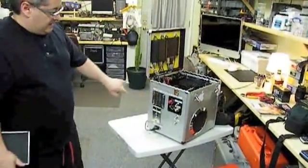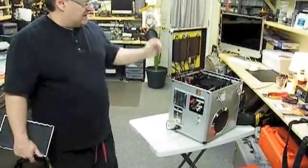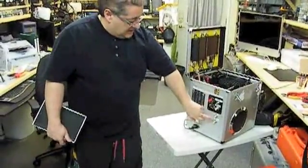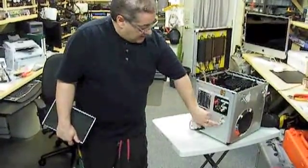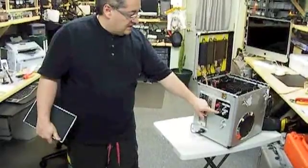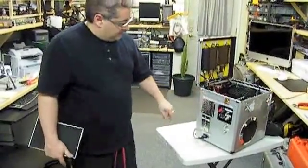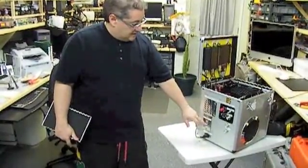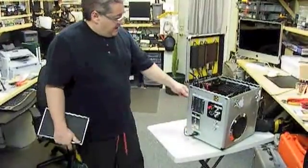This is where all the connections are made. I have a connection for an APRS antenna — I have a small Kenwood that I would put inside here to run APRS with the GPS unit mounted on top of the box. I have the main HF coax connection, a spare coax connector which is going to be hooked up to the 706 VHF port, and then the HF port. I've got external current connections for 12 volt, and also a connection for 12 volt in from a battery or a cigarette-type adapter from a truck. I have a panel here for the DB9 connector for the computer which runs the Airmail program, connected directly to the TNC, and of course the AC supply on this side of the box.